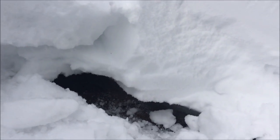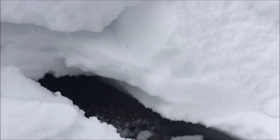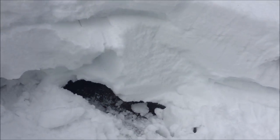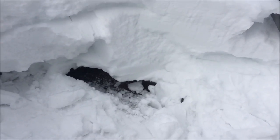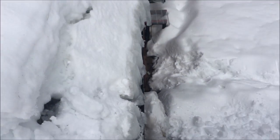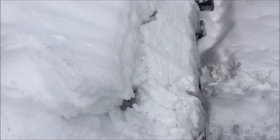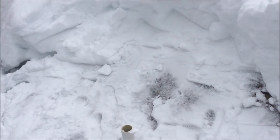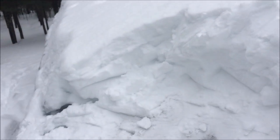You can actually see this little cave that starts getting created in these places as I dig out. Basically it's where the water is melting underneath about two to three feet worth of snow, and that creates these under-snow rivers, if you will, creating these big ice dams — and that's what causes the problems and leaks. If you can dig up a good two to three feet, maybe even four feet above the edge, that will definitely slow the progress of these ice dams.